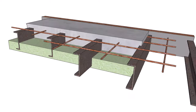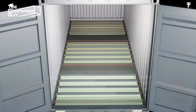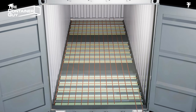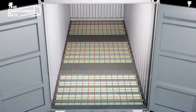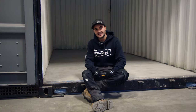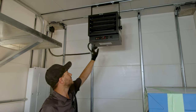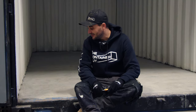The C channels themselves act as a ton of rebar in themselves, but then with the rebar we've run the full 20-foot length plus in between every 11-inch truss member, we also ran a horizontal chunk of rebar. I'm really excited to get the thermostat hooked up and turn it on and just feel what this slab feels like. The absolute best radiant heater is one that you can't see — there's so limited space inside shipping containers, so something like a heater hanging from the wall is just one less thing you need in your tiny home.